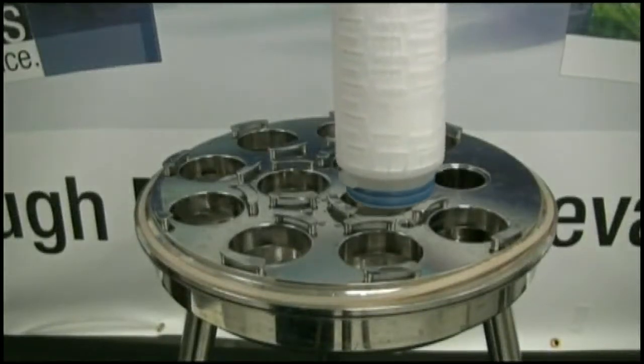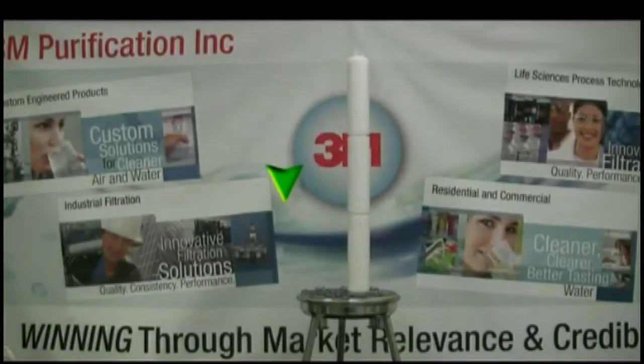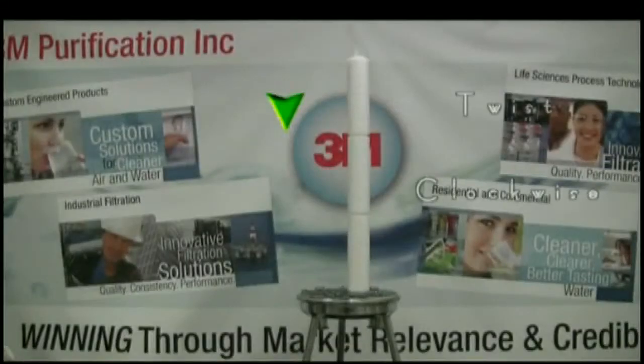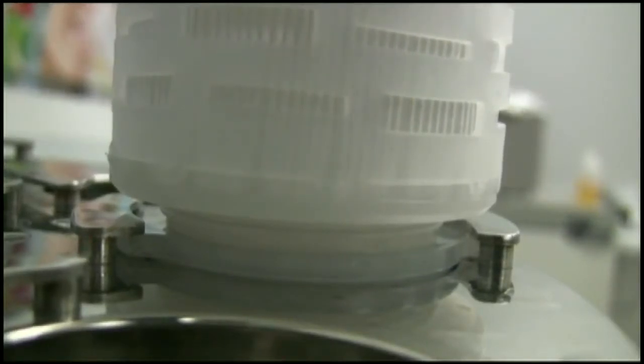To recap: ensure the O-rings are wet. Position the filter with the open end downward over an available receptor on the housing base with the tabs on the filter connector positioned away from the housing brackets. Exert downward force on the closed end of the filter while ensuring it remains perpendicular to the housing base. If having difficulty inserting, re-wet the O-rings and/or exert slight clockwise force while pushing down on the filter. Ensure the tabs on the filter connector are beneath the brackets on the housing base. The filter is now properly installed into the housing and ready for use. If more specific detail regarding any part of this video is required, please contact 3M Purification Technical Support.